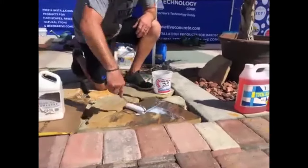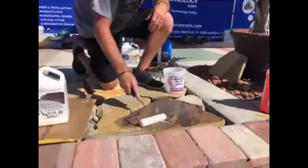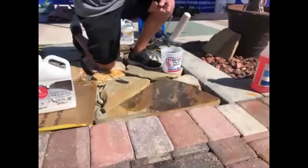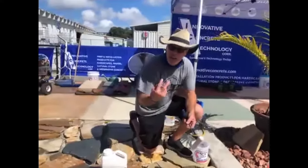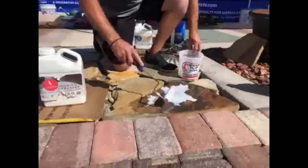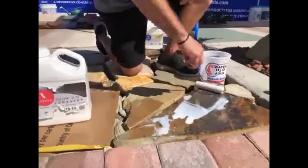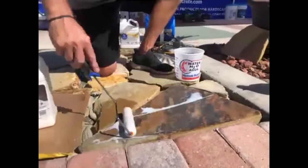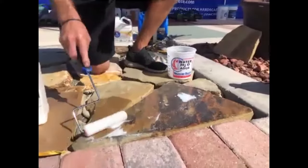This one's going to color enhance — usually it's a one-coat application. The only way you can get a second coat on there is to apply it damp on damp: one guy pump sprays and the other guy walks right back on while it's still damp and applies another coat. You can see how it's sucking right in on this stone — it's taking it in real well. Because it's absorbing so well, I can get a second coat on there.